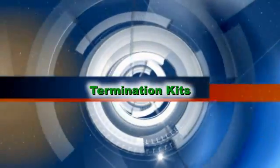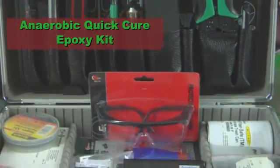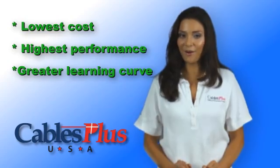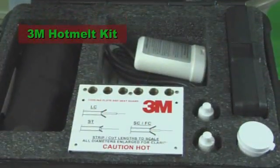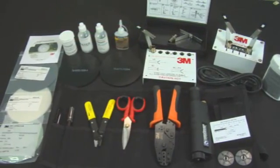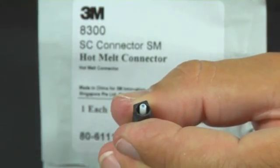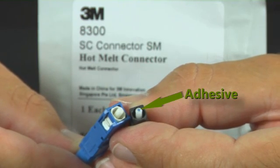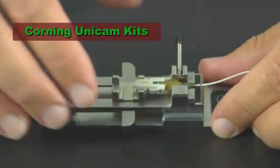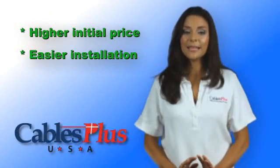There are three basic styles of kits. The first is the traditional anaerobic quick cure kit that doesn't require heat. These kits offer the lowest cost and highest performance, but also a little more technique and learning curve. The second is the 3M hot melt kits, a proven system for terminating the same connectors but with pre-installed adhesive — connectors are more expensive because the epoxy is built in and only activated upon heating. Last are the Corning Unicam kits that utilize a pre-polished fiber end with an internal mechanical splice, with a higher initial price but easier installation.